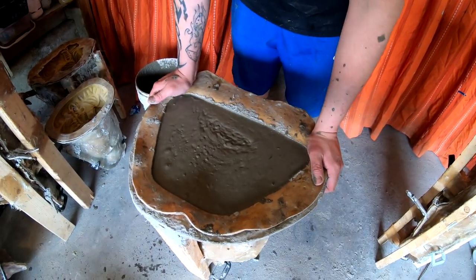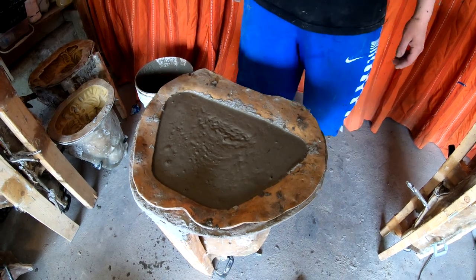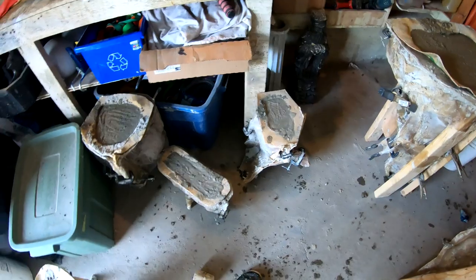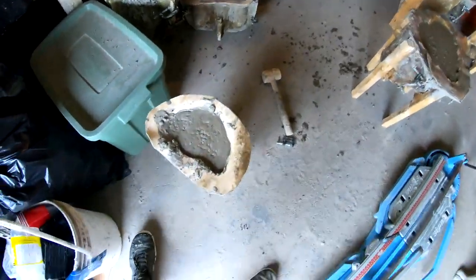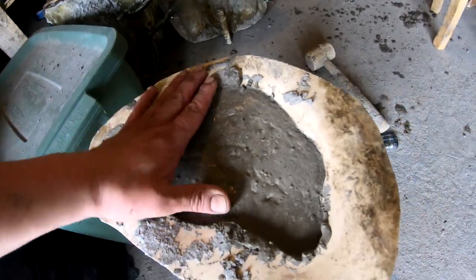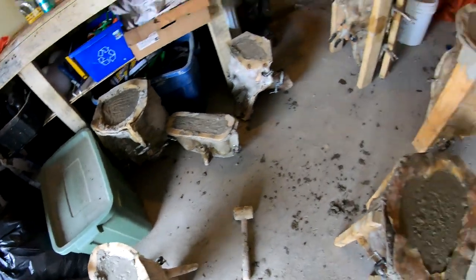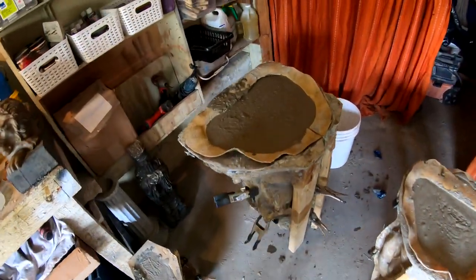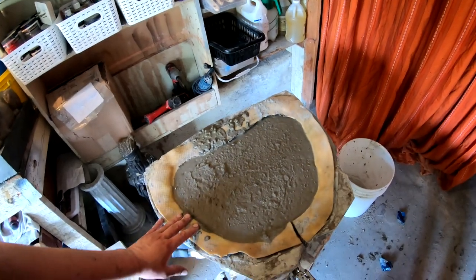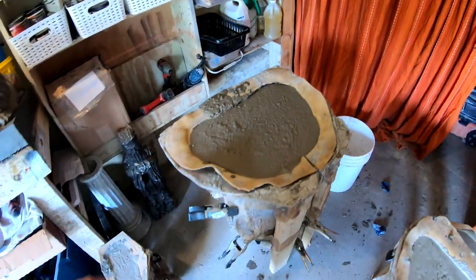This is all finished — I've got to let it sit for three or four hours and I'll be able to pull it later today. Within 10 minutes of pouring it's already rock hard. In about two hours it will be cured enough to remove the statue from the mold. Then let it sit for a day or two to fully cure, but you'll be able to pour three, four, or five statues in a day using fast concrete.